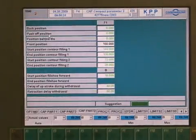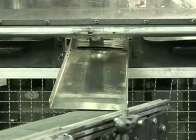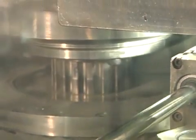Compacting presses, which come in both mechanical and hydraulic versions with pressing forces ranging from around 15 tons to upwards of 1,600 tons, are highly sophisticated pieces of production equipment, many using computerized controls for a host of pressing motions that enable the production of very complex geometries with incredible accuracy and repeatability. As the compacted part is ejected from the die, it is shunted aside, and the process is repeated.